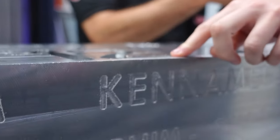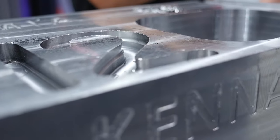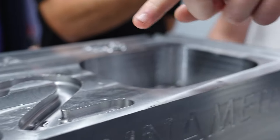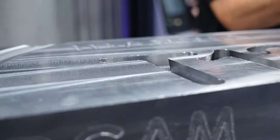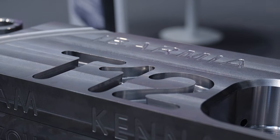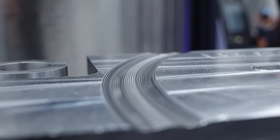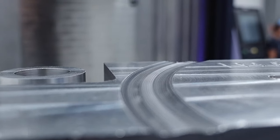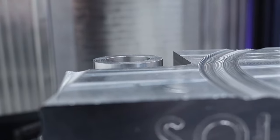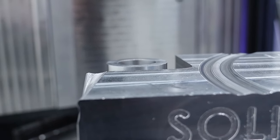Here we used for roughing i-machining, our patented dynamic roughing strategy. And also in simultaneous 5-axis, we already finished this letter and this letter — you can feel that there's a tilting here, there's a slope, and we did that with simultaneous 5-axis. We also did 3-axis and 5-axis roughing here — this is still not finished — and another roughing with i-machining using i-machining in that feature there. Also some more drills and some more engravings.